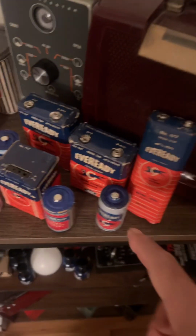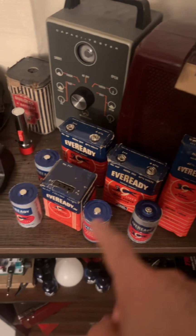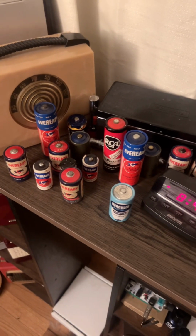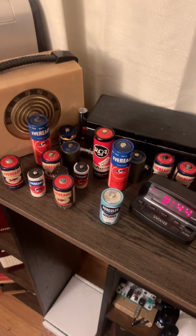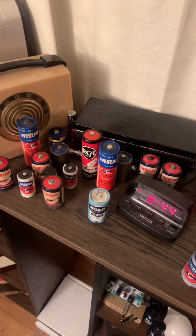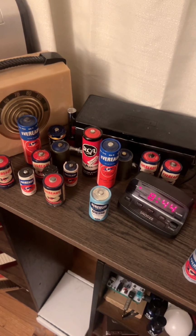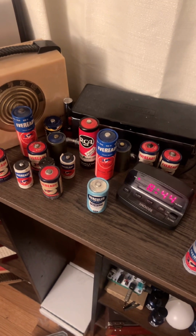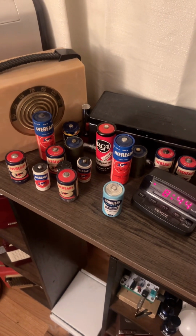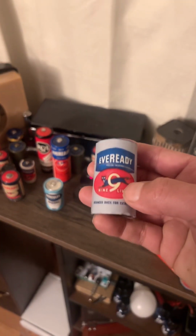These are all rebuilt here. This whole pile is a pile of working batteries. These are not rebuildable. These are collectible. You could probably drill them out and repack them with zinc chloride from a couple of modern cells, but way too much work. It's much easier to duplicate them, as I have duplicated these.